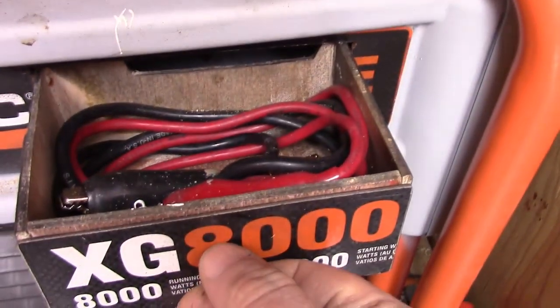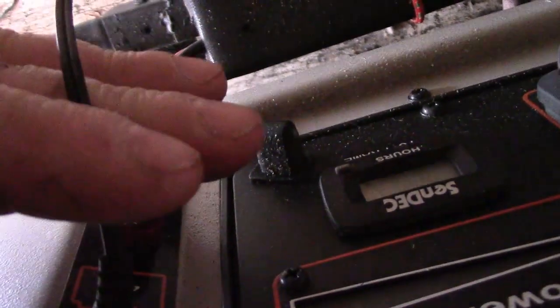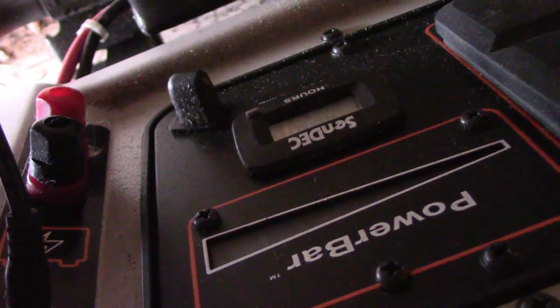And I keep a little spare set of jumpers because the charger, I found this, let me get underneath here for a minute. I'm getting all hung up. If you can see any of this now that I'm inside. This is the charger unit. It's just a small plug like you would find on the back of a cordless telephone charger or something like that. And the wire on that was probably around 22 gauge. I mean, it was thinner than what I have in my hand right here. It was enough to just supply a trickle charge to the battery using the charger that came with the unit.